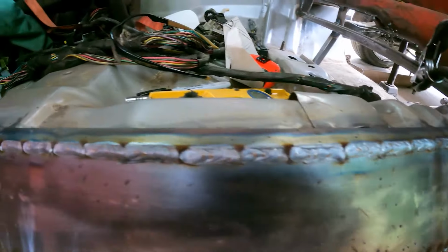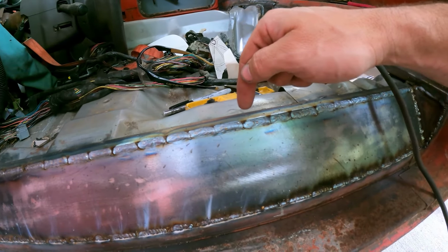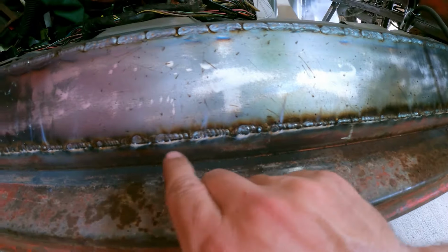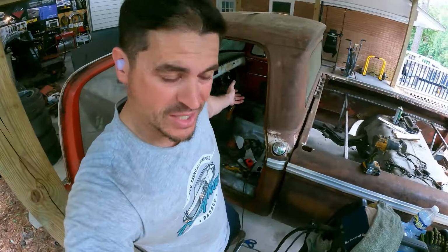But yeah, I'm happy with those welds. I'm not sure if the GoPro does it justice. That's 10 gauge sheet metal tied into 10 gauge square tubing. So I can burn that hot heat right there. Down here I still had to do slow spot welds in little segments because this is 10 gauge tied into truck sheet metal. Running one continuous bead or even little inch beads takes a risk of blowing through because the metal is 60-year-old metal on this thing.